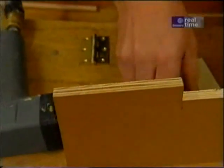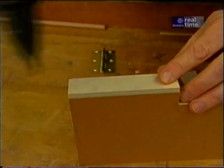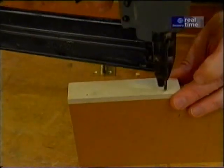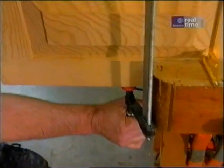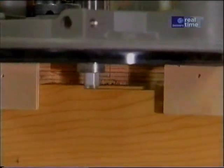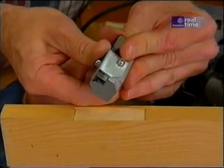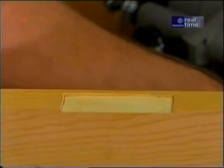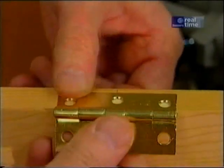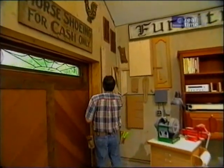Now what I want to do is just take a couple pieces of quarter-inch plywood and nail those on as a stop. Let's give it a try. I clamp the jig with its center line aligning with the center line of the mortise and I simply route it out. I'm cleaning the corners out using my corner chisel — I could certainly do it with a conventional chisel. Let's just slide the hinge in place. That's the way it should look. Jigs — where would we be without them?